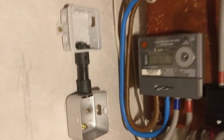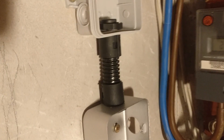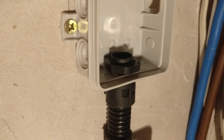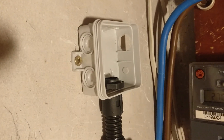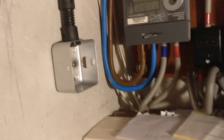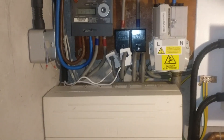I've mounted the power junction box on the wall with raw plugs and fitted the 20mm flexible conduit going up to the junction box where the Shelly unit will be housed. It's screwed in with a capping screw to keep it in place, so power coming into the junction box can travel up through the conduit into the Shelly unit. At the top right of the Shelly unit there's already an exit for the two transformer supply cables to run down to the tails.